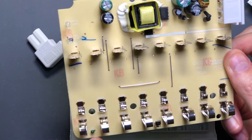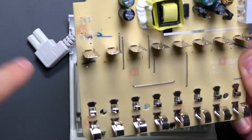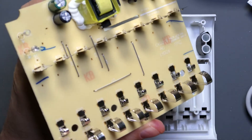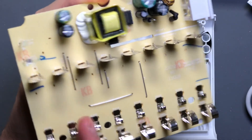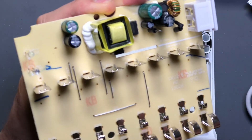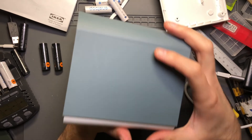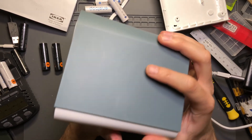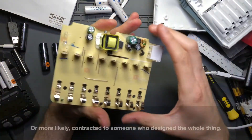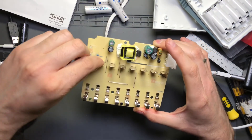I just spotted the temperature sensor - RT1 - right there. It's weird that it's there rather than anywhere near the battery bays. But there is a temperature sensor. I think based on the way they're charging these, perhaps because they designed this to have the lid over it, this whole construction has been evaluated in one complete design - which makes sense since they designed it themselves - so this temperature sensor is monitoring the whole thing, whether you have one cell or eight cells.